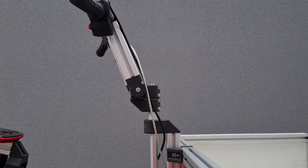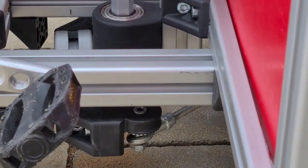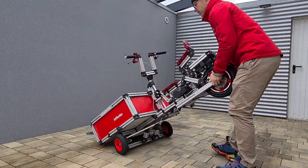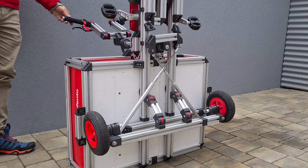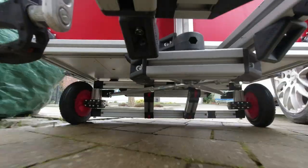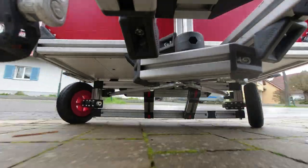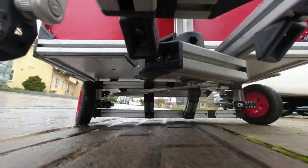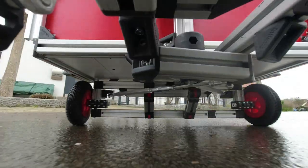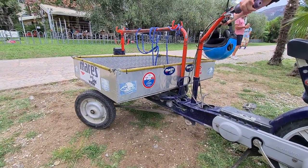The vertical steering column is linked to a bar, and on each end of this bar we see one pushrod going to each front wheel, but in a crosswise manner. This all happens in a flat space underneath the front container. It took me a while to understand that the steering was going in the right direction at all, not to speak of an Ackermann effect. But it works brilliantly with very few parts. My appreciations to the Italian designer.